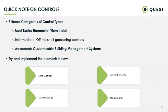As with anything, there's always a need to dial in your space. Being able to make data-driven decisions is huge. You can still make a thermostat-humidistat combo work and get those things staged, but often they don't data log or have remote access, so there are some limitations there. Always encourage people to consider going at least with an intermediate level control to make sure you're getting the most out of your HVAC system and have data to really make decisions about your airflow and other things.